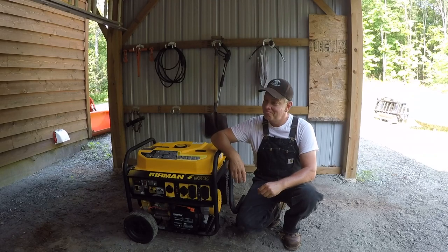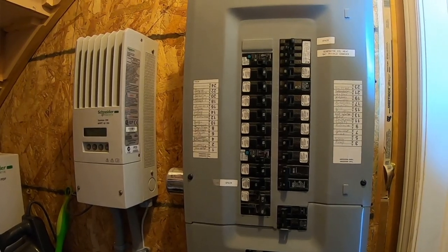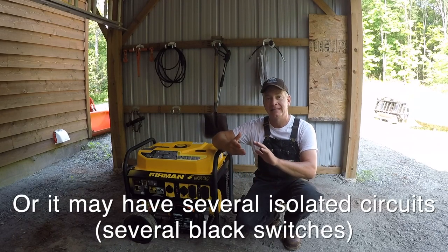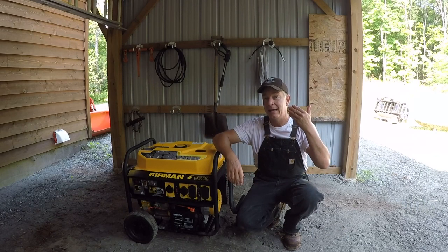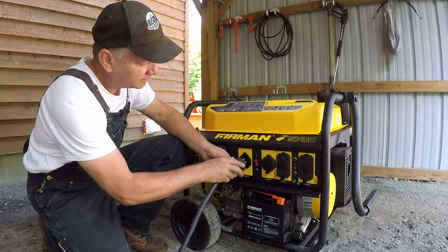So how does it work? Same as the first example. You're sitting in your home, you realize your utility power has gone out. Instead of automatically having generation come on by itself, you have to do it yourself. You head into the hydro room, you'll see the transfer switch — usually a big black switch — you flip that switch, which connects your house to the outside plug and disconnects you from any external electricity source. Super important. Walk around the back of the house, take that big long cable, plug one end into the house and the other into your generator.